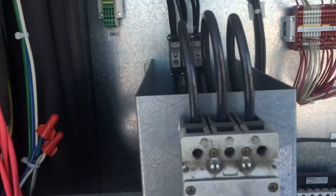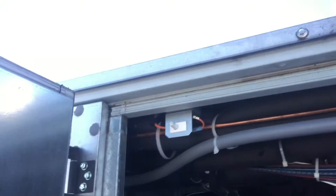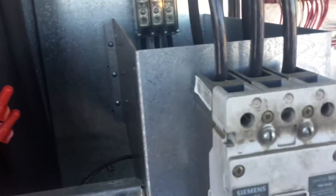This is a much easier way of doing it. Now if I need to make an adjustment, simply turn the power off — the blower's not running, the door's not getting sucked in, I don't have tape falling off pin switches. I make a quick adjustment, turn it back on again, I can see what happened, shut it off, adjust. It's a much quicker and safer way of doing it.